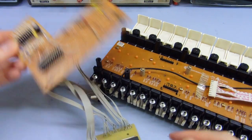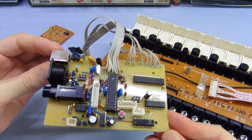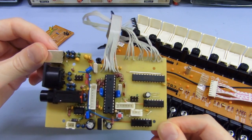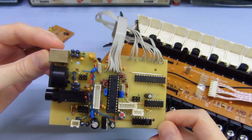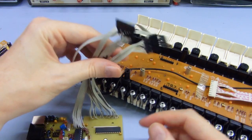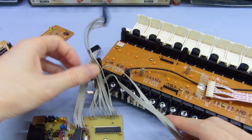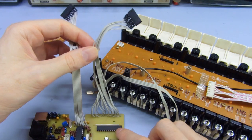I've pulled the original prototype part — this would be like the alpha version, and this new one would be a beta version. Like I said, the board layout does have these errors, especially for the USB control chip, so I would definitely want to optimize this if I were making another one. If anyone else for some reason needs one of these themselves, it definitely isn't perfect and needs some work — bear that in mind if you take the files. I've been reattaching these wires which connect to the keyboard: there's a ribbon cable here that one connector plugs into, and then these two cables plug into two headers here.